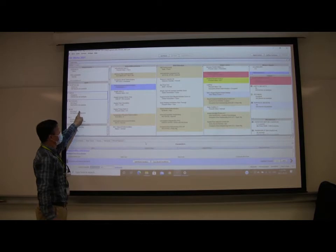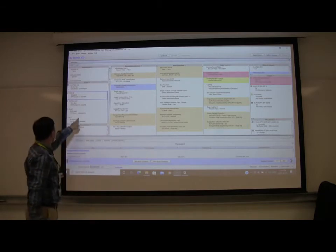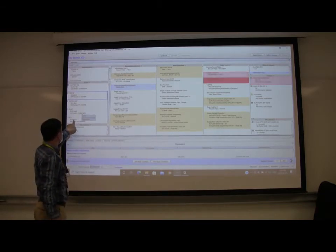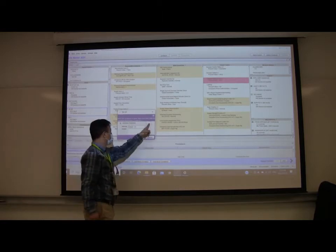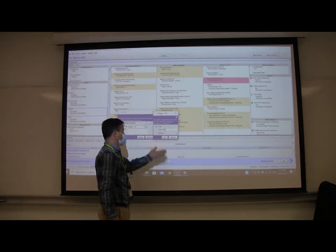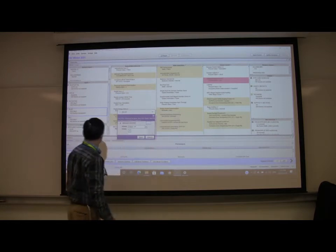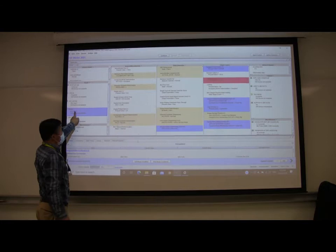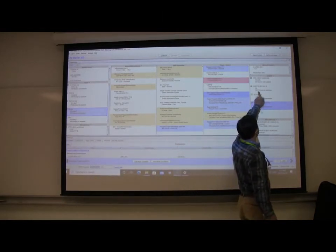Now we set this point, this one, to lower. Set this one lower than room temperature. Command. Then we make it 60. 64. Okay. And then okay. Now the set point is 60, lower than this temperature. So the heating is off. But this one is still on. Right.